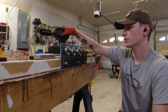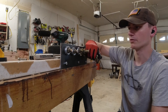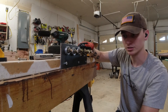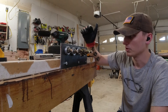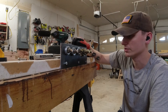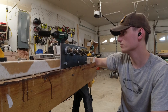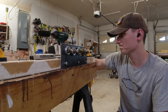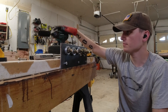I'm not going to go to the 4 amp-hour battery today because I'm running out of muscle strength, and I'm going to need a cheater bar for next week and a better platform — this bench isn't secured, it's just sitting on sawhorses. But as of right now, the MasterForce has maxed out at 205 foot-pounds of breakaway torque, which is pretty crazy. Its fastening torque puts it a little over 100 foot-pounds on the small fasteners, and for the larger fasteners there was 154 and 142, so adding about 20% puts fastening torque around 170–180 foot-pounds.